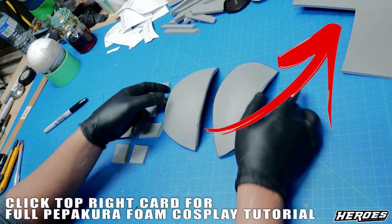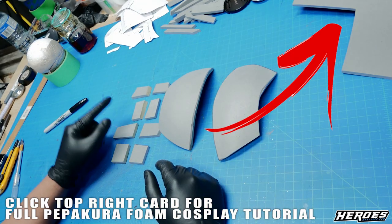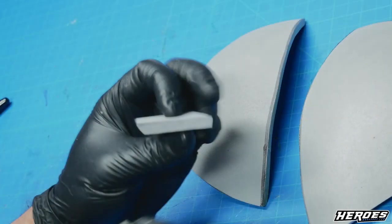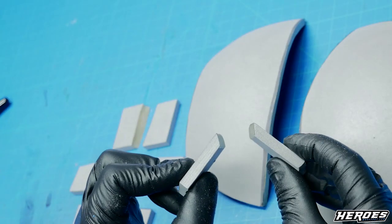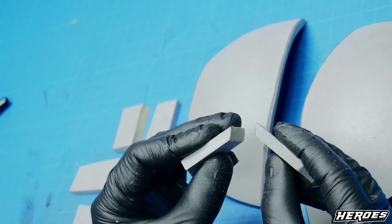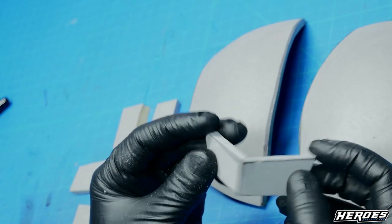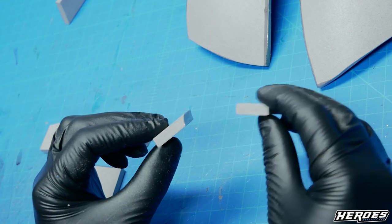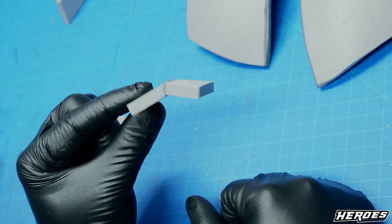When dealing with curves, I'll show you what kind of cut to do. First, let's say a sharp 90-degree angle — I would cut both pieces that are going to connect on an angle. When you join them and glue them together, you'll have a nice 90-degree angle. Next is a slight angle: you angle-cut one side and leave the other as a straight cut — there's an angle, but not as sharp.